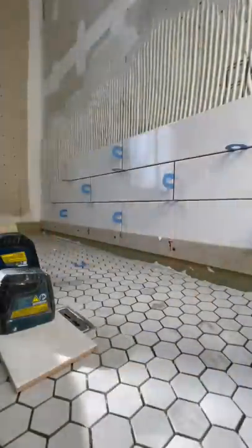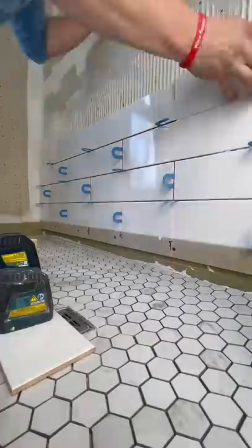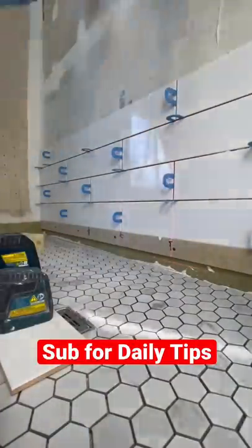Then you'll come back the next day to piece in the bottom. I never trowel out more than four rows of tile, because it starts to dry up towards the end. Back butter every piece and you got this — nothing to it, you can do it.